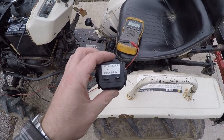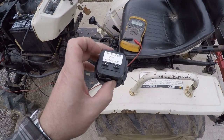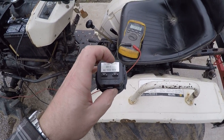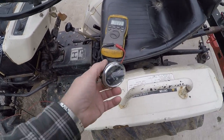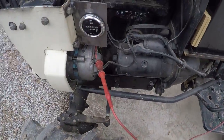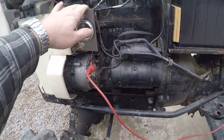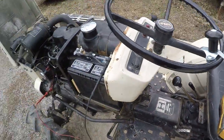It says it will take AC or DC input, 6 to 80 volts. If you do put DC, positive is on the right, ground is on the left. I got one installed on here and I just put it over here because it's kind of big and I didn't want to cut holes on the side of this or mount another bracket there.